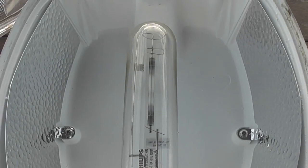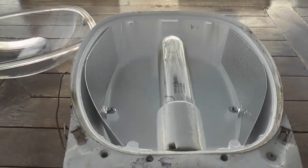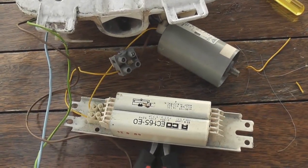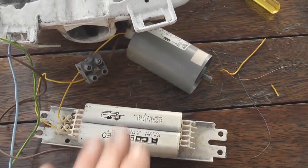It seemed to work — otherwise it used to short out and blow the fuse. I'll demo that later on. The one-hand rule, not ideal. Plug there. I caught this on the lamp and we strike it. It's hot now, so the strike is good. I'm very pleased that it works with a fluorescent tube ballast. I may have to put two in parallel, but it doesn't seem to overheat. I've been running for a while — it's warm, but it's not hot.